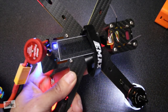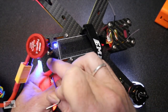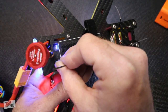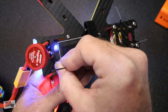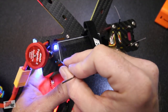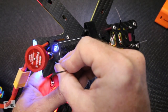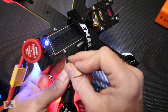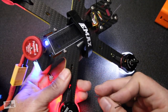With a battery plugged in, I'll show you how to change bands and channels on this VTX — it's pretty simple. You'll need a small tool since your finger won't fit in the hole. A short press changes through channels on the current band. To switch bands, press and hold for two seconds and it activates the band switch, cycling through bands A, B, C, D, H, L, and back to A. Press and hold for two seconds again to return to channel selection. You're on band A and can switch through eight different channels per band. I wouldn't recommend switching between 25 milliwatt and 600 milliwatt while the quad is powered on.